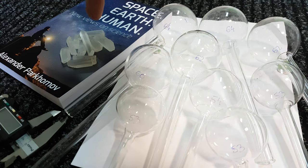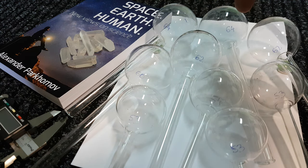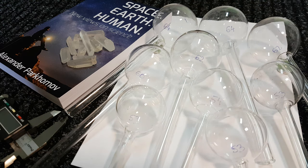The difference is this one is crystalline and these are blown amorphous quartz. The reason you choose quartz is because it's able to go up to 1700 degrees plus, and that allows the plasma to operate for at least a reasonable amount of time before the containment vessel fails.